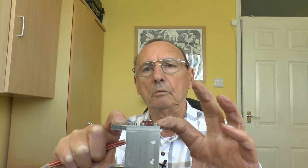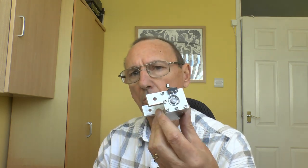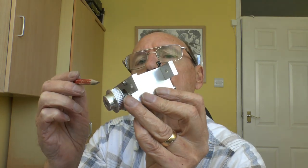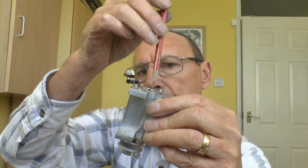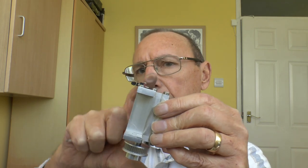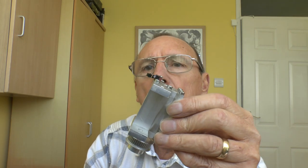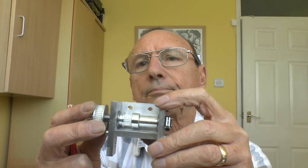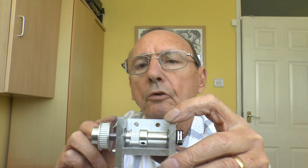The way I made these: I made the top and bottom plates slightly bigger, then made the center section with the top and bottom plates on, and then machined around the edges so they line up perfectly. Then I bored through for the bearings for the pulley shaft in one piece, because they had to be perfectly aligned. I didn't want to bore it first and then bolt the plates on in case they didn't line up properly.